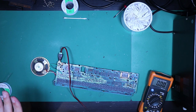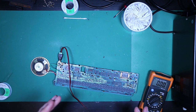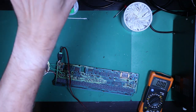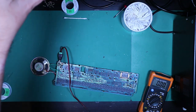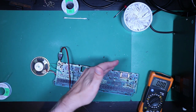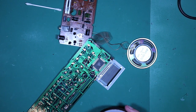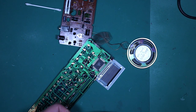I've never done any surface mount work before so this is a new experience for me. I think the right thing to do is to try and get the chip out of the VL1 first — since that doesn't work anyway, if I mess up that process it's not the end of the world. Whereas if I mess up taking it out of the working PT-10 first, I'd have broken two keyboards, which is not what we're aiming for. So I'm going to start with the VL1. I'm now putting heat insulation and Kapton tape around the chip area so I can go in with the hot air gun.